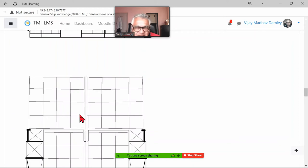Normally, it is not done unless you have got port, center, starboard hatch covers, and it is possible because hatch cover weight is restricted to 45 metric tons maximum. Generally they will be around 40 tons. How do we reach this figure? Because the container cranes, the QCs as we call them, the big cranes which load and discharge containers, have got a capacity of 45 tons. That is the industry standard. So, you make sure your hatch cover is about 40 tons, 42 tons, and that's it. It is marked there anyway. So, the crane driver also knows whether he can lift it or not.